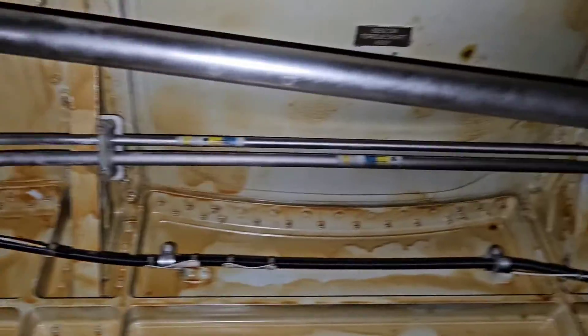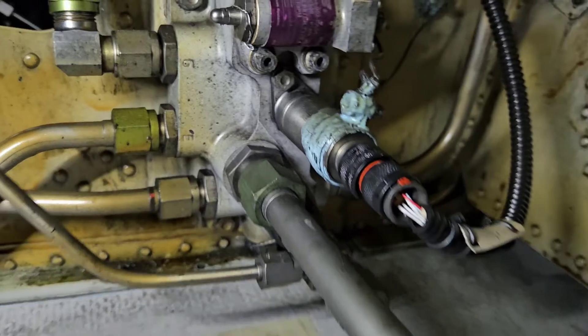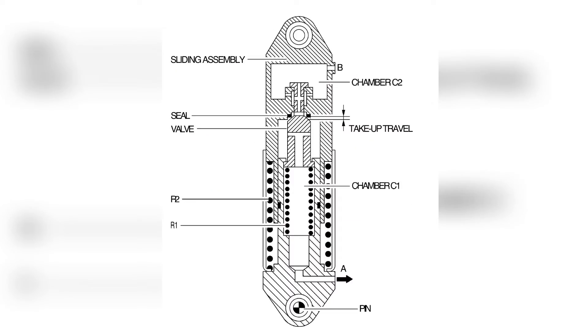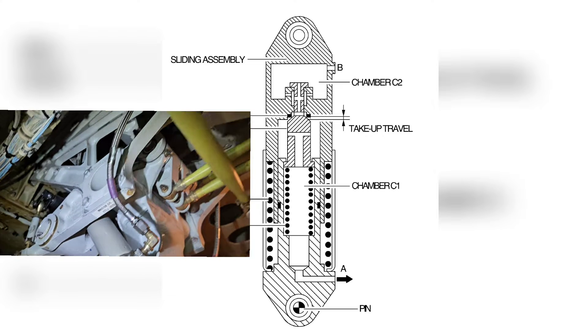Information for the triple gauge indicator comes from three different pressure transducers, two of which we can find here. One on top sends information about pressure from the left, and one on the bottom about the right landing gear brakes. The hydraulic pressure transducer can be found on the brake manifold. Now let's take a look at the functions, starting with the master cylinders, which are located under the first officer pedals.